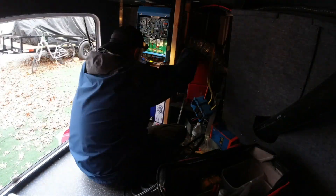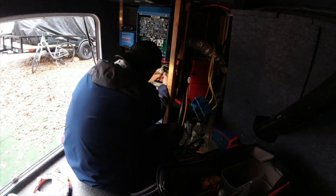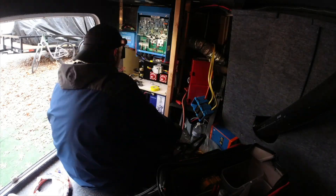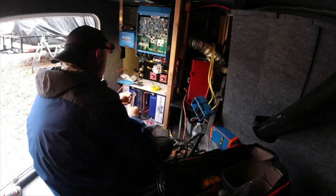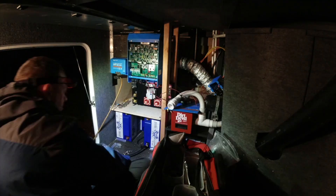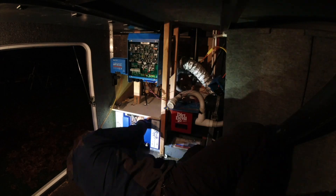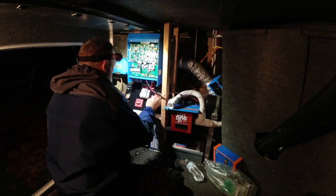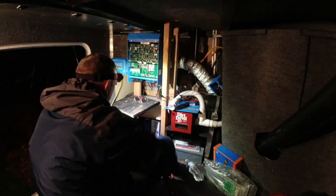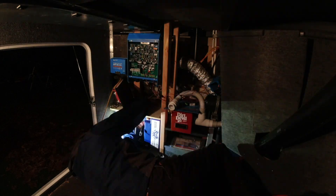Once I get all the batteries wired, the next thing to do is to start putting in the automation and getting the interrupt to insert the Multi-Plus wiring in between the transfer switch and the main breaker panel. I had to undo some of the battery wiring to get everything wired up through into the back of the shutoff panel with all the breakers and switches.